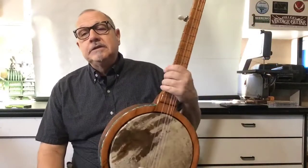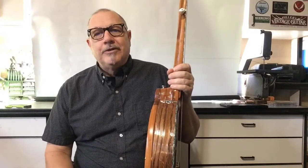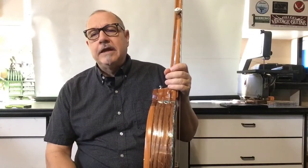That's it. The clear coat I use on most of my instruments — I keep coming back to it because it's simple. It's just spray lacquer in a rattle can. I tend to use Deft gloss spray lacquer, or Deft satin lacquer for a satin finish. When I seal the grain I've been using an aerosol spray shellac — it's a natural product from lac bugs in India. I use that as a grain sealer, usually a couple of coats, sanding between each coat. Then I start putting the lacquer on, which gets rid of some of the raised grain. I hope you enjoyed this video — we'll be on to some other project soon. Lord bless you.